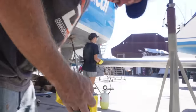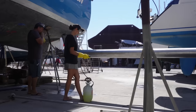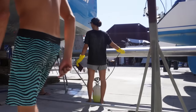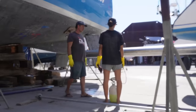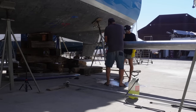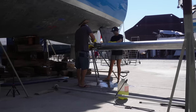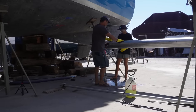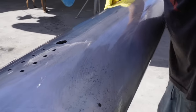In an ideal world we probably would have painted the mast, but in our situation we couldn't do that, so this is the best next solution. The raw aluminium looks good - it looks tough and we like it. One important thing when wetting the aluminium: it's really important to wipe any drips off because it can stain and change the colour. So we wash it, dry it completely, make sure it's clean, and apply this afternoon once the sun goes.